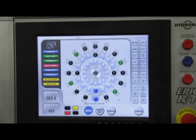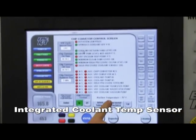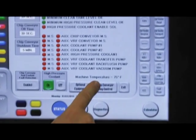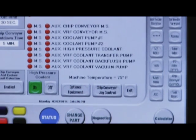Updates to the EPIC control programming features. Navigating from the main menu, there's an integrated coolant temperature sensor where we've actually installed probes in the machine, and the machine has to be within a certain temperature range before allowing it to go into automatic.